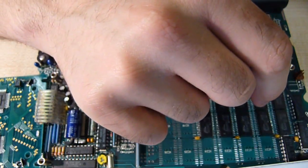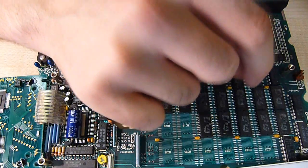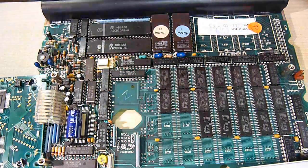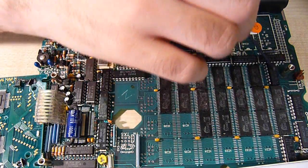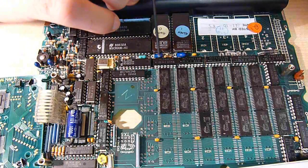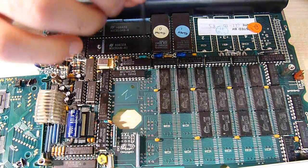Then there's a multiplexer, another multiplexer, and that is just a NOT gate chip — there are about six of them in total. This is a 74HC32, which is a quad two-input OR gate. So this has four little OR gates in it which all take two inputs each. We have some more multiplexers along here and then another quad input OR gate chip.